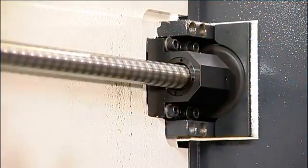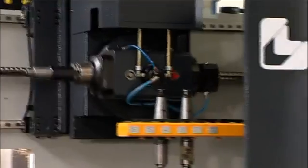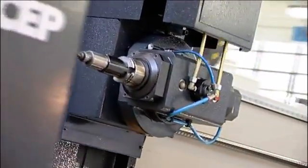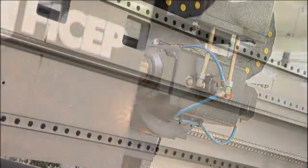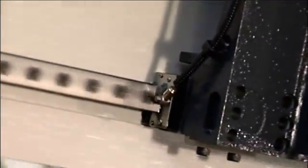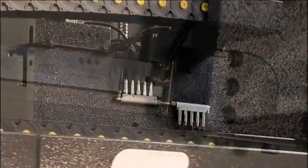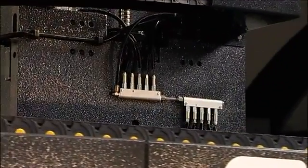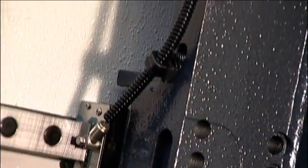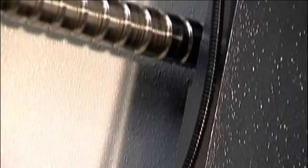The Y-axis positioning speed of the drill head is 30 meters per minute, or 98 feet per minute, to minimize process times. The massive drill head is guided with dual prismatic ways to achieve maximum stability. Lubrication of all critical points on the Orient 11 is accomplished with an automatic, centralized lubrication system.